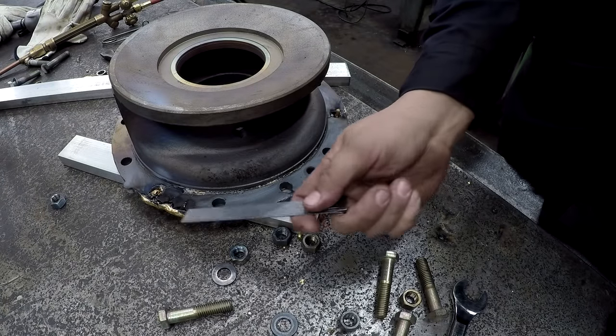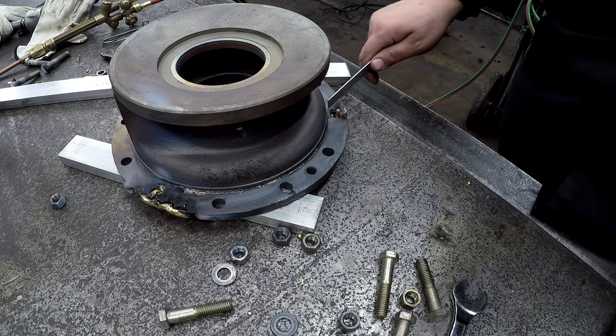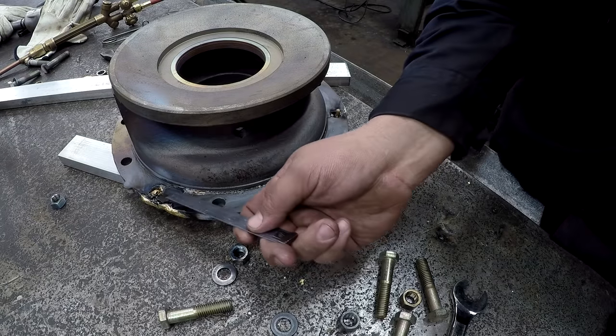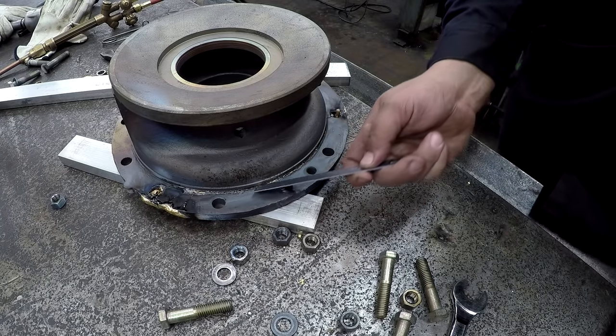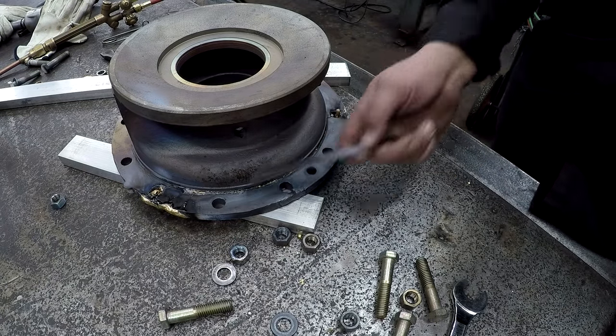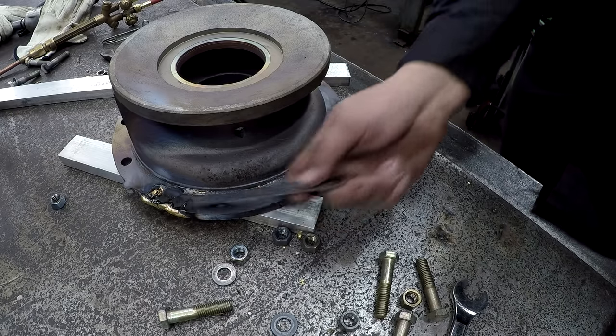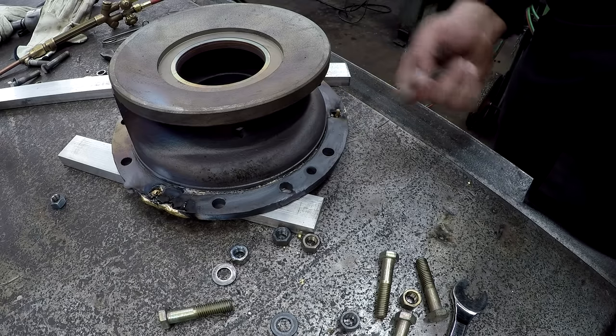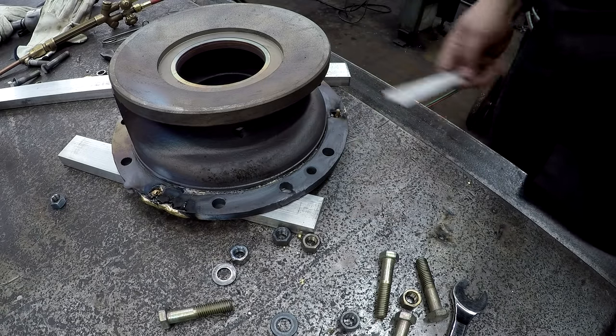I'm gonna go ahead and get the little grinder with the carbide burr and grind out the little cracks there and go ahead and fill those in, and I'm going to run one bead all the way down this little crack here where it didn't fully fill it in, and then after that we'll be able to let it cool down and we'll set this up in the lathe and machine this off, clean it up.